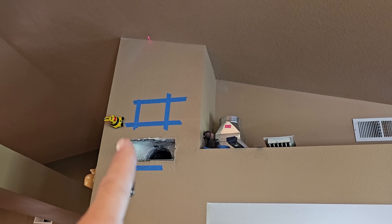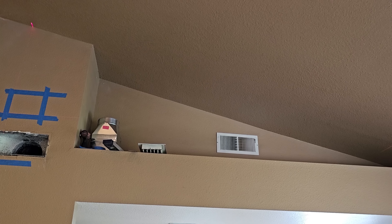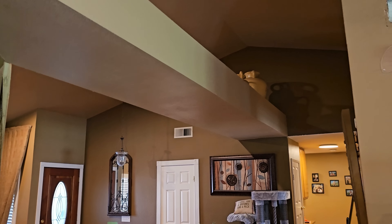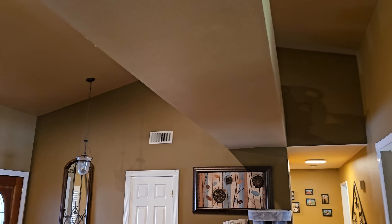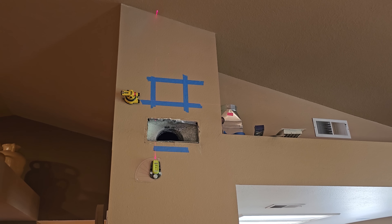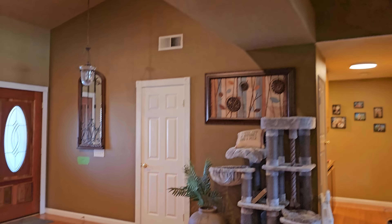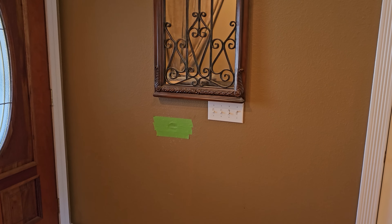We're going to be cutting in that one. I brought it up higher because it wasn't level with the other one, and we're going to be putting another one right there, and then cutting in a new kitchen one. Everything's going to get smaller. On a lot of these I'll end up going higher too, and we'll just patch over those because it seems easier to patch the entire hole rather than patch half of it. That's why throughout my whole process I haven't patched any of my holes — I just taped them up because I knew I'm going to get a drywall guy to come in when I'm all finished.